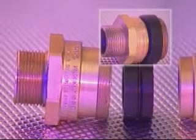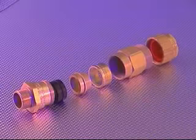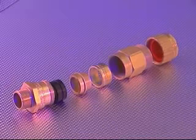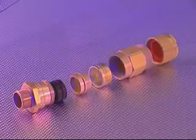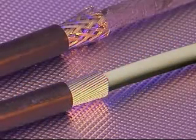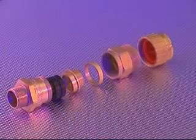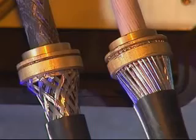Complete with captive deluge boot if required, this cable gland accommodates all types of elastomer and plastic insulated cable incorporating all types of armor or braid, the most common being single wire armor (W) and wire braid (X). The 501453 dedicated armor cable gland is fitted with individual rings to suit each type of armor or braid available.